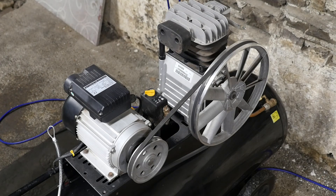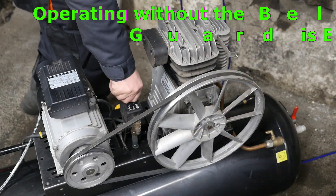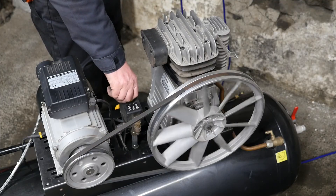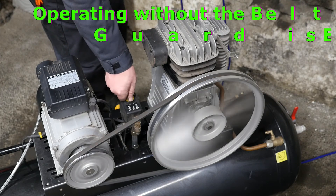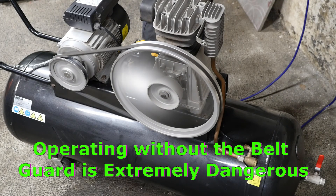I'm thinking perhaps it's to do with the air coming out of the air compressor itself. My thinking is to now create an air leak on the outlet from the compressor by loosening one of the air fittings. With the pipe removed, when the motor turns the compressor over there shouldn't be much compression, so it should be easy to turn over — and it works, motor's happy, compressor's happy. Then I put the pipe back on assuming the motor would stall, but it didn't — it actually carried on running like everything was fine.